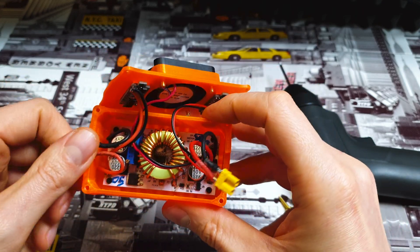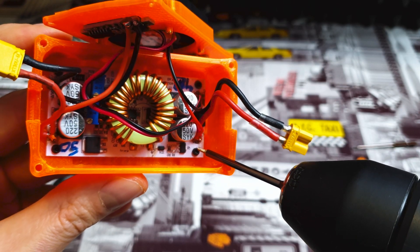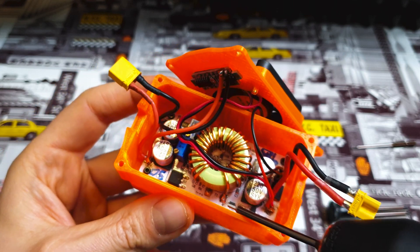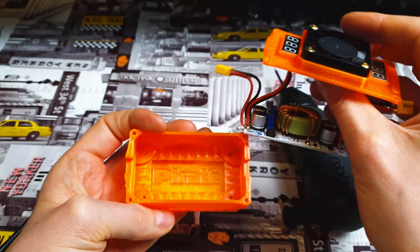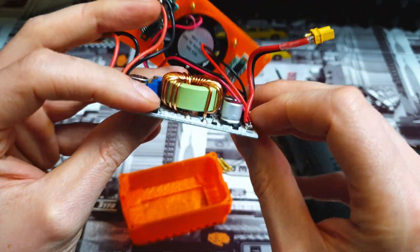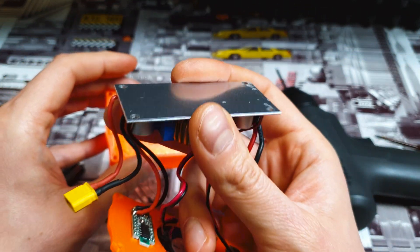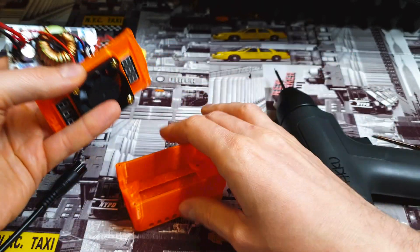Let me also show you how it looks under the step-up converter, because there we've got some nice air vents and air channels. I used super tiny M2 screws — thanks to them there's a smaller chance of a short circuit, because there's really small space between the wires and the screw and only those fit here. Under the step-up converter there is a nice aluminum plate. I recommend this step-up because that aluminum plate is a must-have — it really helps to spread the heat, and there's a very small chance that this thing will go boom due to overheating.